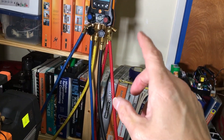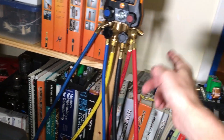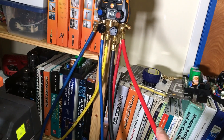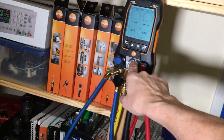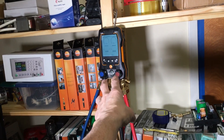I actually want to do the gauges only, so the valves will be off. I'm going to be turning off the valves because I don't want the test to be messed up by hoses — if the hoses leak, that won't tell me whether the gauges or internals leak, or maybe even the sight glass. So I'll be turning this up to 450 PSI.